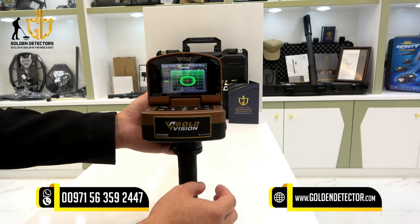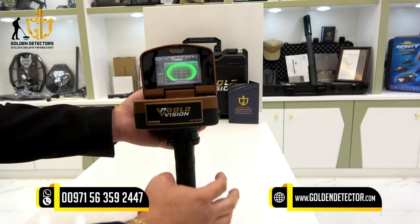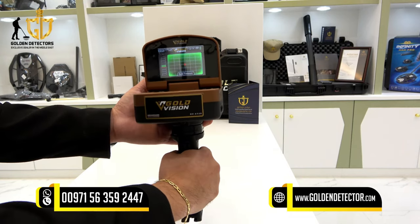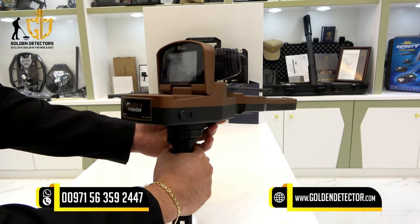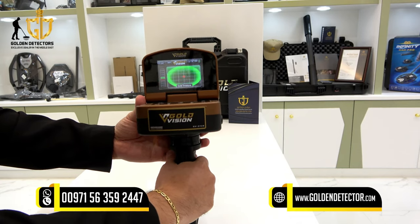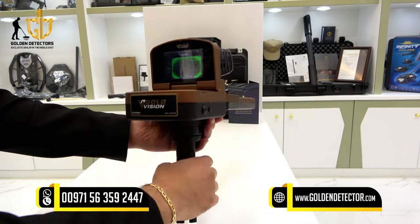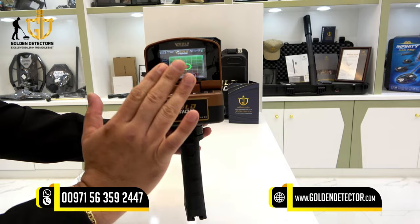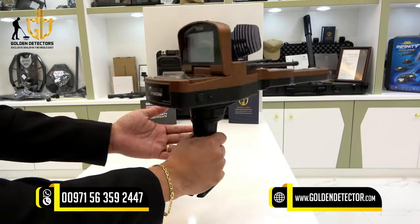After pressing OK there is a smart balancing indicator that should be on green. Unlock the handle to let it rotate freely. If the device turns right or left but does not do a full 360, it means it is detecting a target on that side — just follow the direction. If the target is directly under the device, it will rotate 360 degrees continuously.